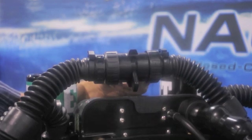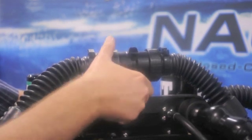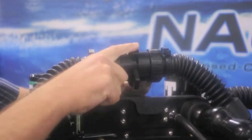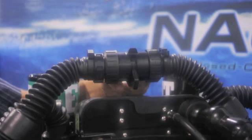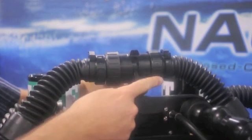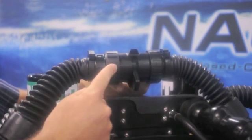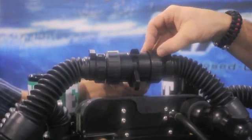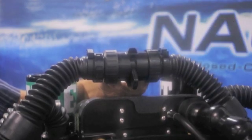Moving down to the DSV, this is the lever that opens the system. The finger tabs here allow the diver to open it with just one hand. On the DSV, there's a difference between the two nuts — one's marked with a left-hand thread and one's a right-hand thread, which helps the diver not make the mistake of reversing the flow of gas.